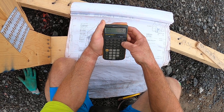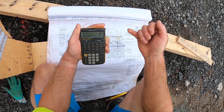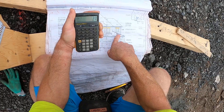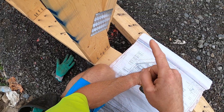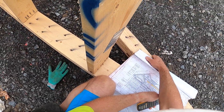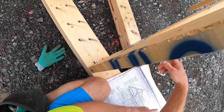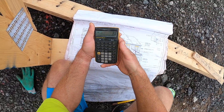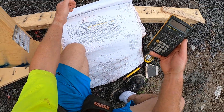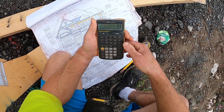It gets reduced to 3 and 15/16ths — I want to see that rafter cut by the way. So basically there you have it. Now to find my long-to-long block that's going to sit on this double girder — this is three trusses but only two of them are the girder, I've got to break the bands, and the one is going to sit two feet back. So because it's a double girder, I'm going to sit it on top and then nail a 2x4 to give it that extra beef to sit on later.